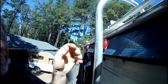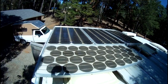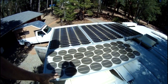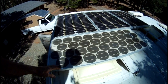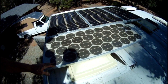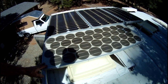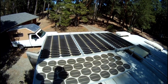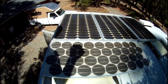Up on the roof, I'll show you what I've got. I had this one 40-watt panel originally, and I tried that at first but of course it wasn't nearly enough to keep up with even my small amount of electrical use. After learning more about solar, I added three more 50-watt panels, so now I've got 190 watts up here, and I never run out — it works great.